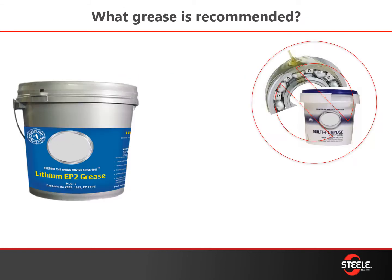We're often asked what grease we recommend. Per our lubrication chart, we recommend an EP (extreme pressure) lithium-based grease. It has an NLGI consistency of number 2 and a bearing load range of 40 or more. Do not use all-purpose grease or ball bearing grease.